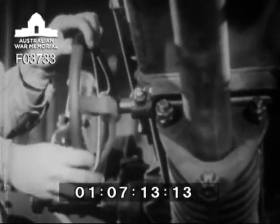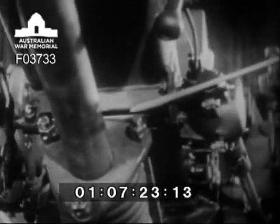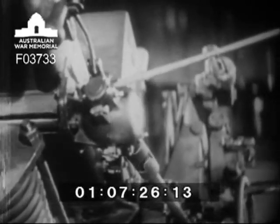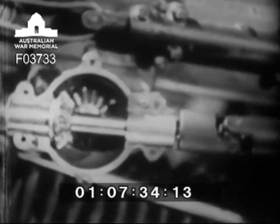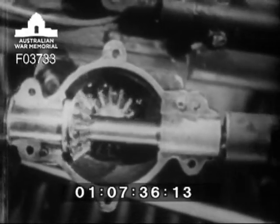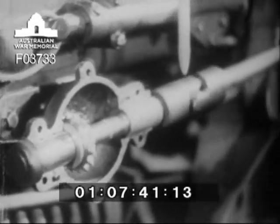Suppose you were using the left hand wheel. As it turns, it rotates a shaft that crosses under the cradle. On the other side, a beveled pinion meshes with the beveled gear. We have removed the cover to show how the power is received from across the cradle, and sent up alongside the cradle. The beveled gear and its shaft are connected by a flexible joint to the shaft running up to the right hand wheel. Here another beveled pinion meshes with the beveled gear, causing the hand wheel to turn.